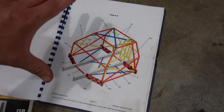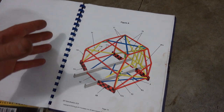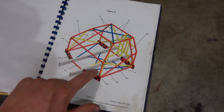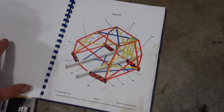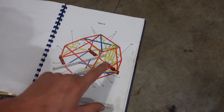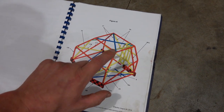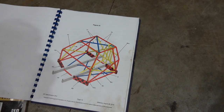Your cage does not have to match this diagram exactly — this is just a general overview of what it looks like. Everybody's is going to be a little different. For example, this blue bar right here can actually go the opposite way, but that's all stipulated in the rules. Some of our stuff, like these bent bars, are actually inch and five-eighths, 083 wall, because that's what our bender is for.